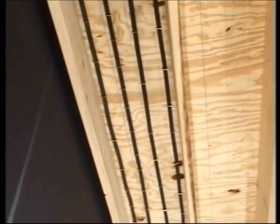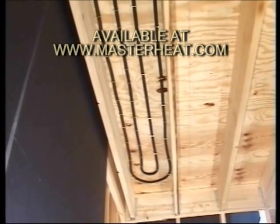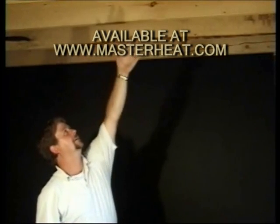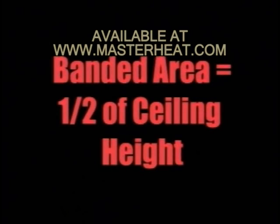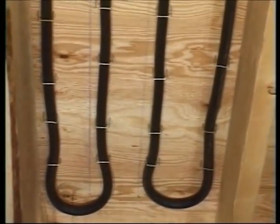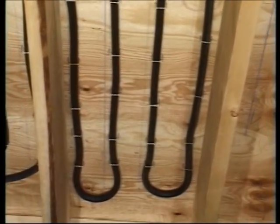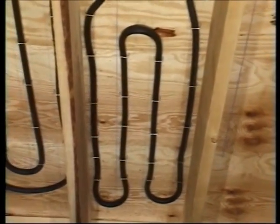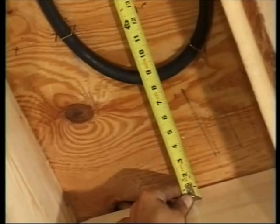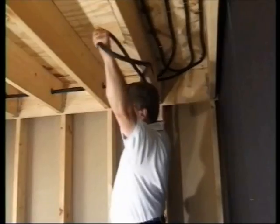Because of high heat loss in this area, we're securing Onyx on four-inch centers with staples placed every six to eight inches. A good rule of thumb is to extend your banded area from the exterior wall a distance equal to half the height of the ceiling in the room to be heated. If the banded area is perpendicular to the exposed wall, double the loop back on itself, creating an M pattern. Staple the Onyx loop eight inches from the perimeter of the room to allow a full eight inches of insulation later on.